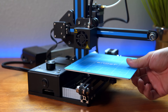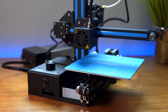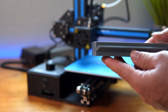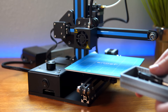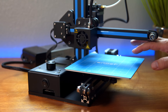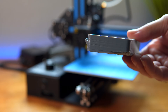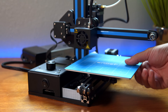Looking underneath, I thought maybe the wheels were loose and that's why it's moving around. I didn't even know I had this problem until I was printing this tray and one of my ends lifted — you can see. When I pushed on it, my bed was kind of like this and it whacked everything off. This is why it didn't turn out good and you can see lines in it. In any case, we need to figure out what's going on.